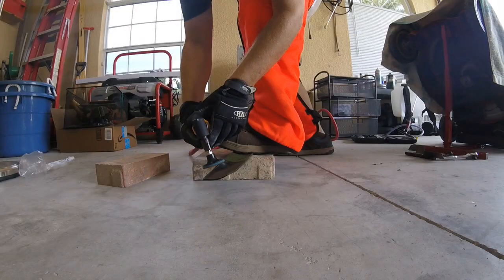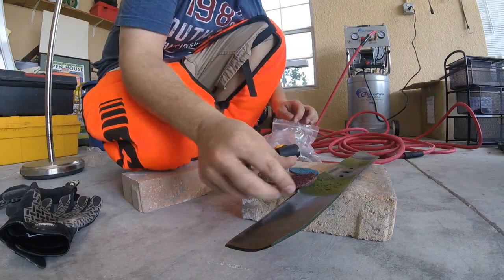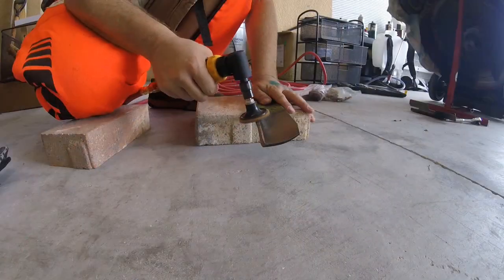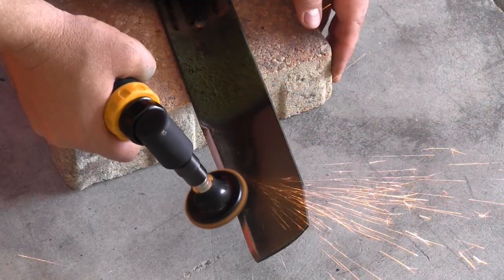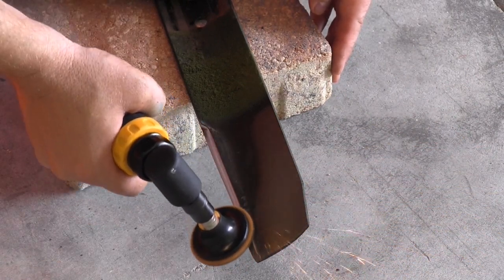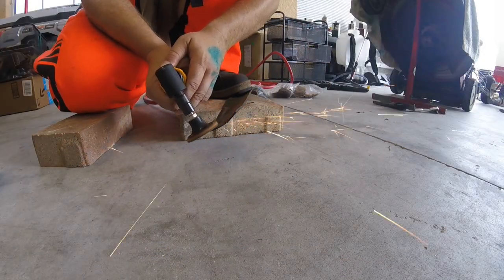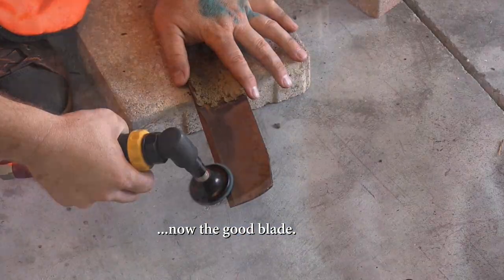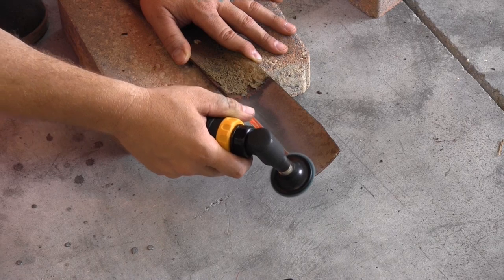I tried to be safe — I put on steel-toed shoes and some chaps, wore face protection, wore eye protection. The first blade I'm doing here is unsalvageable — just a horrible blade. I used it to cut the front lawn, so you can see the nastiness. This is my practice blade, and I really tore it up. I started with the more coarse pads and those were too harsh — I ended up completely rounding it over. It looks nice and shined up, but the blue pad is the least coarse.